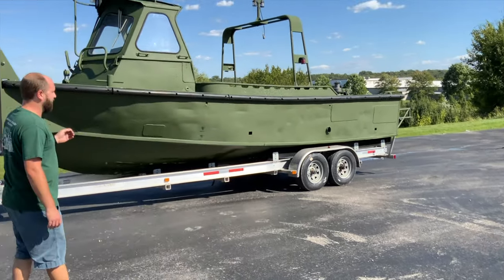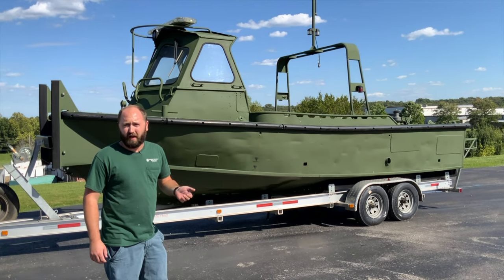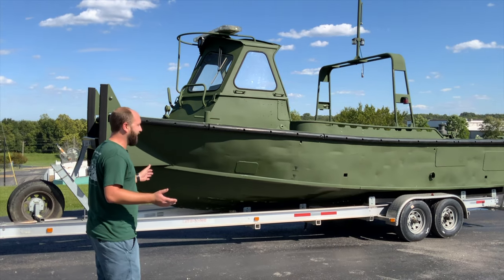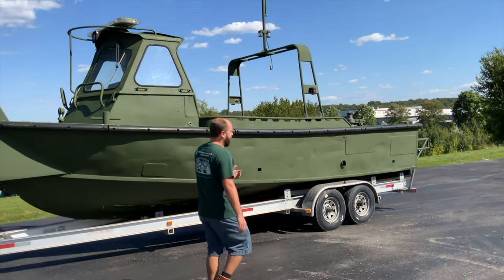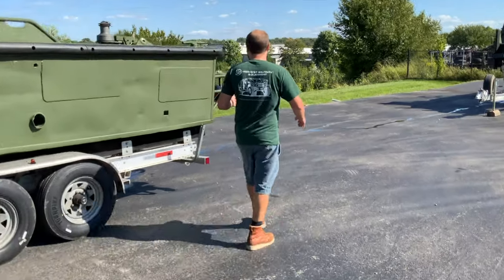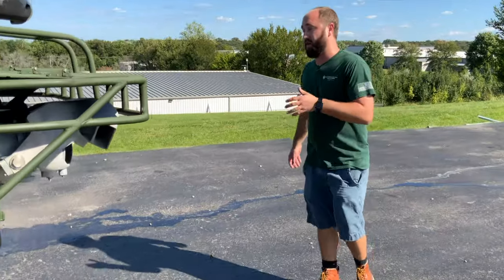They have 5.9 turbocharged marine diesel engines in them. They're actually a 12-valve, all-mechanical engine, just like a lot of your, if you're a Mopar guy or a Dodge guy, 12-valve Cummins were some of the best engines ever built. They're 210 horsepower. At the stern of them, they are powered by twin UltraJet jet pumps. So these boats draft very little water. We have actually river-tested both of these boats, so we put them both in the water, run them.